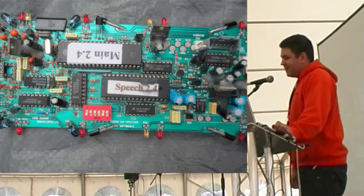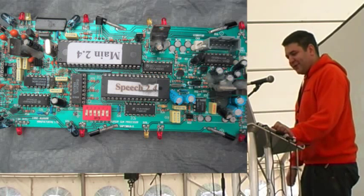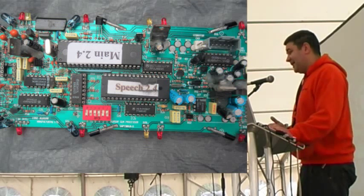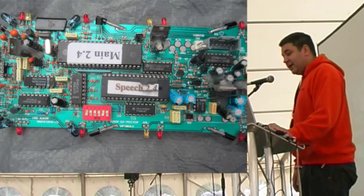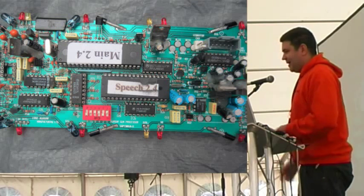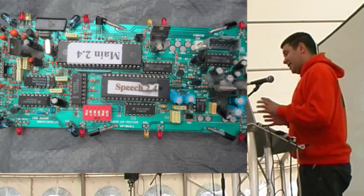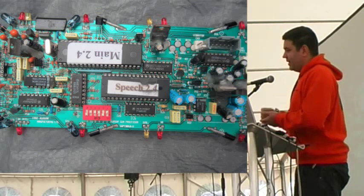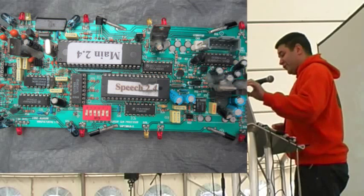This is the main circuit board of a Quasar gun. All the components here you can still buy - this system was designed in the late 80s, and literally every component is available off the shelf to this day. The main processor is a Motorola 68HC705C8. In a similar way to processors like Atmel, PIC chips, and so on, it's everything integrated - it has its own RAM, its own ROM, its own peripherals built into the CPU. Everything is stored inside that main CPU.